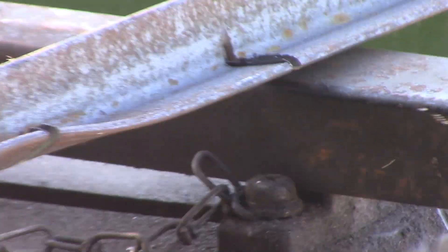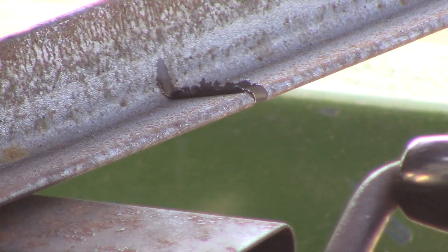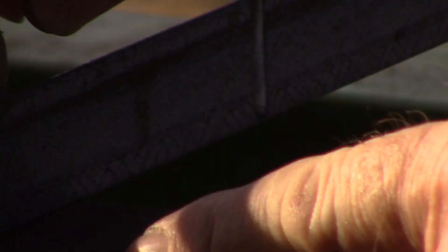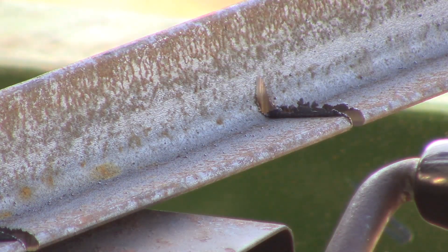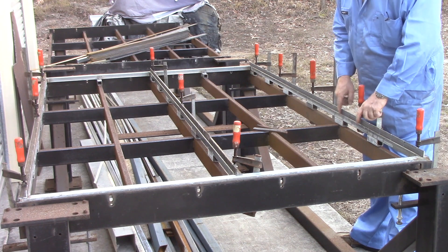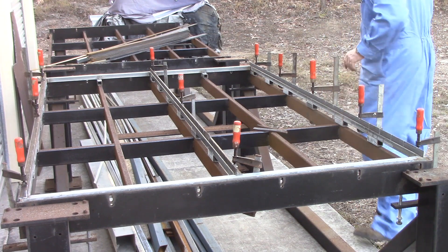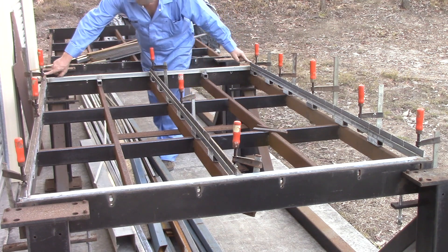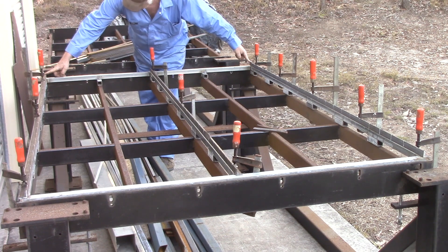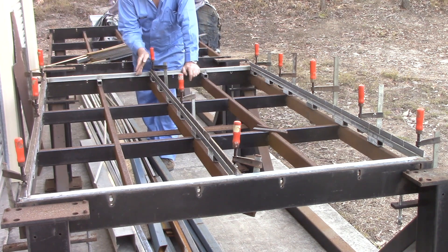I got this cheap because it had that bend in it. This is what I wanted to show you — I've made the cut until it just touched the bottom. That way all the pieces going in there will sit down on this bottom piece; the cut piece will sit in like that. Sacrificial bars will go in the slots and all sit level on this bottom piece. The cuts on these ends line up within a millimeter or two — about within an eighth of an inch. I can see they're out maybe a millimeter and a half, so about a sixteenth of an inch. But it's near enough for the purposes — they're only to hold the sacrificial bars.